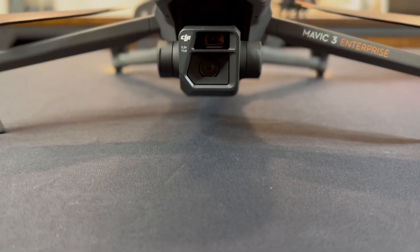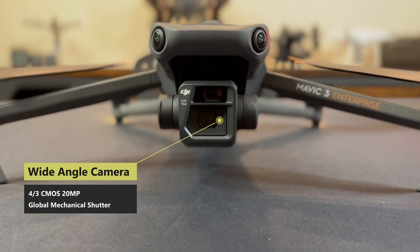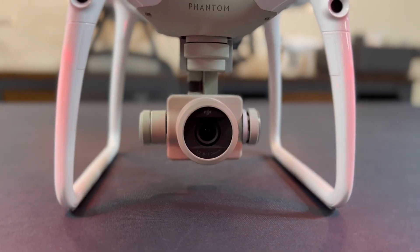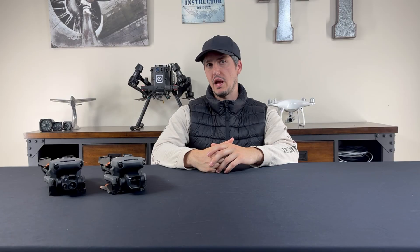Let's compare the M3E's camera to the P4 RTK's. The M3E has a 20-megapixel four-thirds wide-angle camera with a global mechanical shutter, and it also has a 56x hybrid zoom camera, making the M3E a bit more versatile compared to the P4 RTK. The P4 RTK only has one sensor — a 20-megapixel one-inch wide-angle camera. Off the bat, the sensor on the M3E is larger, which will result in better models. But aside from sensor size, the M3E's camera is capable of substantially lower shooting intervals: 0.7 seconds versus 2.5 seconds on the P4, allowing you to fly missions at faster speeds. Lastly, the M3E is capable of taking images in JPEG and RAW, whereas the P4 series is only capable of JPEG.